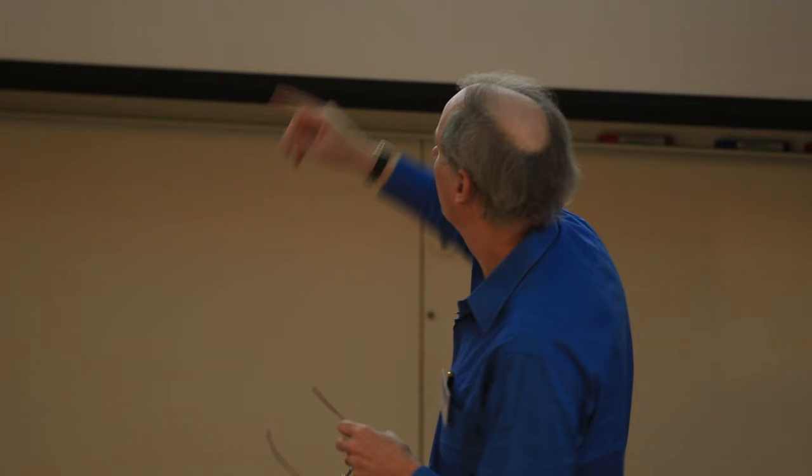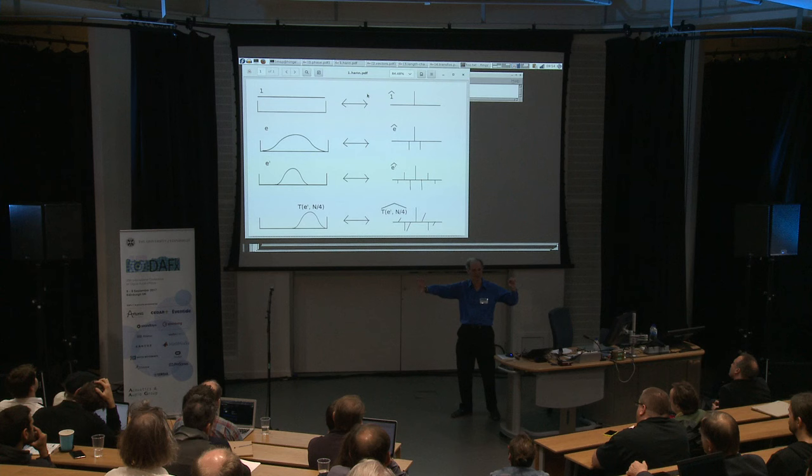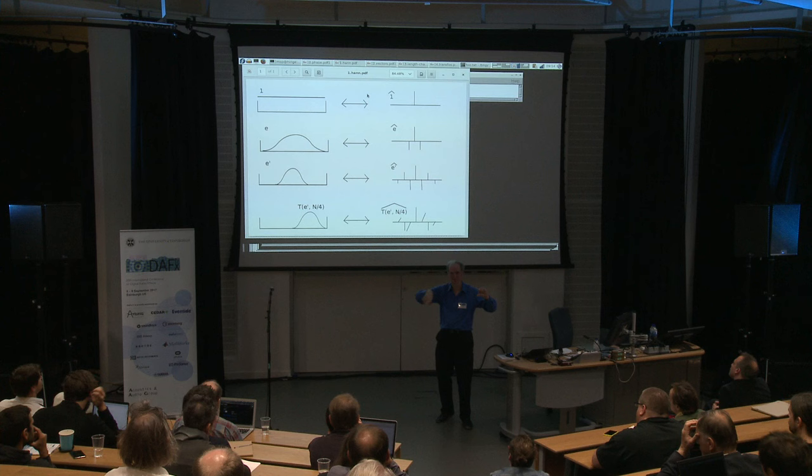just to confuse you. Why are the signs alternating between positive and negative? It's because the way most DSP Fourier transforms work is they put 0 at the very beginning of the window. If you put 0 in the middle of the window, kind of where Fourier thought it belonged, then this thing looks a lot nicer because everything is pointing in the same direction. Everything looks like it has 0 phase. But a cosine whose peak is in the middle of a window, if you use the standard FFT, actually looks like a negative amplitude because the peak should be at the ends, which is right where you wish they wouldn't be because that's right where you're wrapping around.